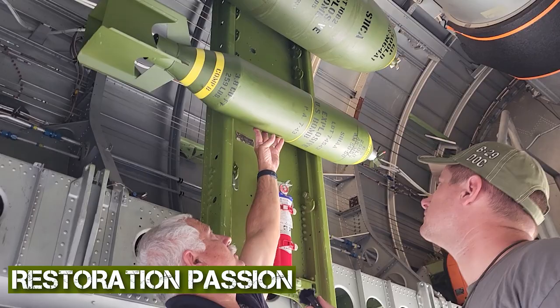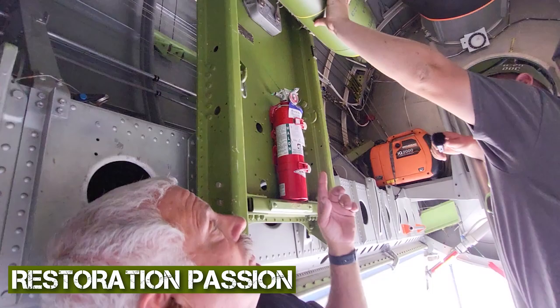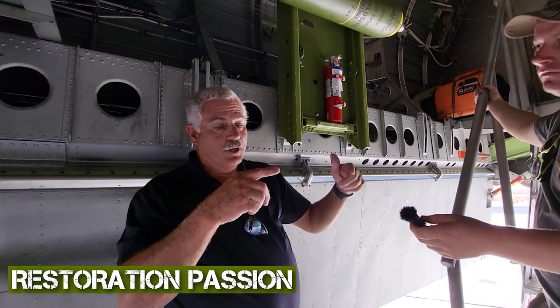There's a bomb shackle, and the fingers on the little bomb release were electronic, and they have two fingers. In a normal release, one finger pulls, releases the bomb from the shackle, but the safety wire that goes through the fuse stays on the shackle, pulls through the fins at the front and sometimes on the back. The 500-pounder has an aft fuse as well.